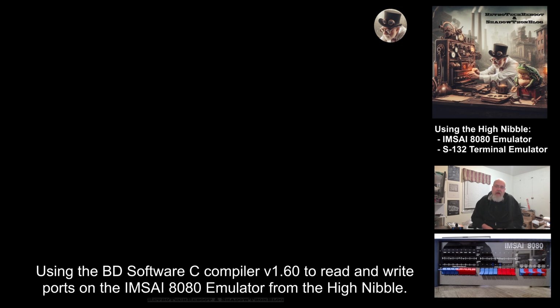and then I'm going to have a loop running in the software that'll count from 00 hex to FF hex, and it will AND that information with what it reads off the switches. That way, if one of the switches is down, like I've done there, we can mask that bit, and the LED will always be off. We can mask any bit or any combination of bits that we want to here, just to give it a bit of variety so we can see it run.